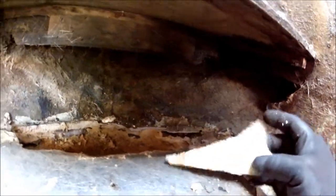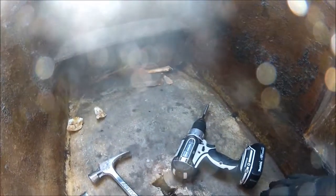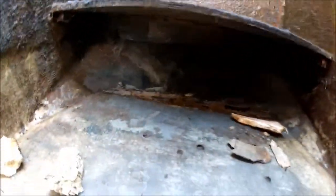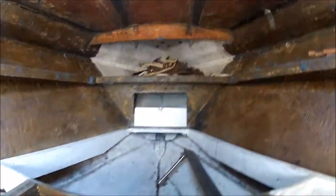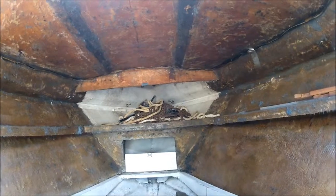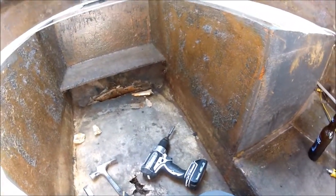This is a styrofoam, just like from a cooler. It's almost like they put some kind of a nose plug or something in there, and this is just all wet underneath there. And once I pull this center deck up, I'm pretty sure what I'm going to find is some foam with nowhere for the water to go. And what I'm suspecting is that somehow water from the chain locker, which is up here in the very front of the bow, has been able to migrate down through this compartment down into the center passageway, which certainly didn't help. I think it's too much.